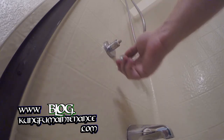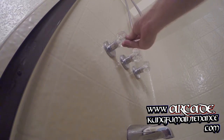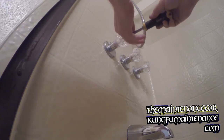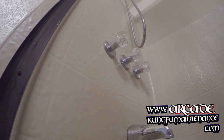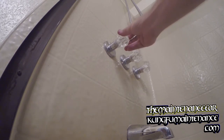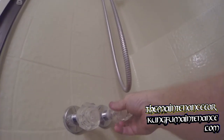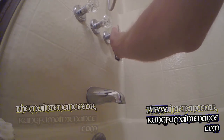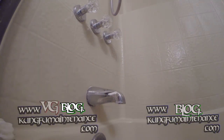I like to position the escutcheon with the worst looking portion down as it's the least visible. It's also a good idea to clean it up while it's off — you can shine it up a bit. Center the screw, add our index button, and now everything is indexed properly. I like to set these nice and straight up and down. A little TLC just makes it better. The index buttons are now correct — hot, the directional arrows rotate up for a shower, down for the tub. And the hold button — I'll fix that now as well to make it nice and straight. We're good to go.